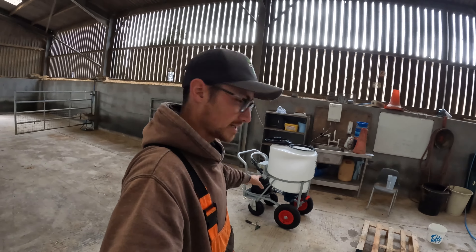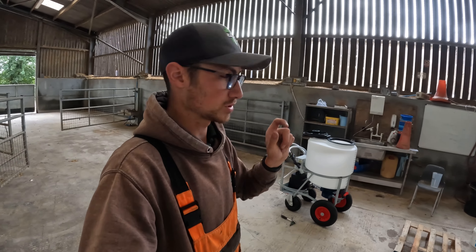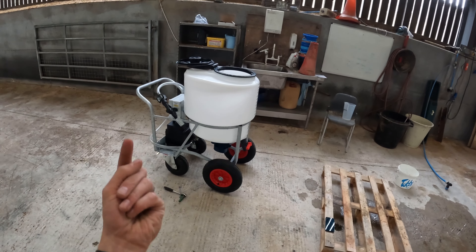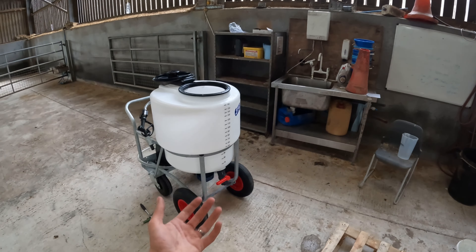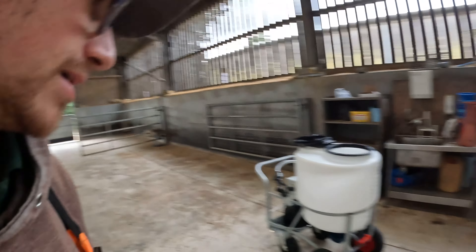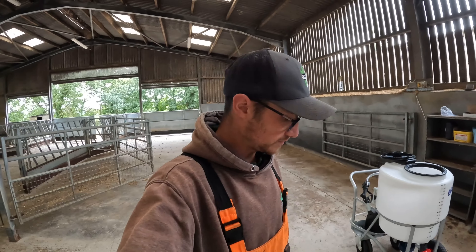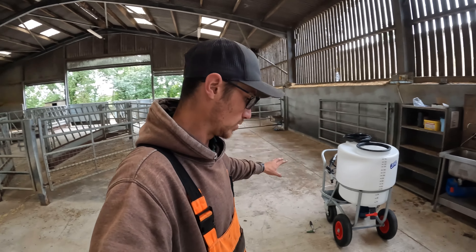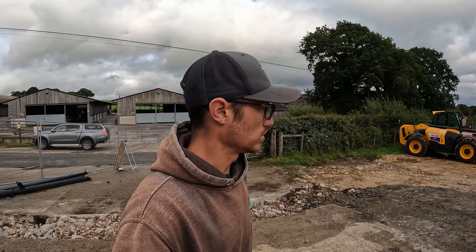I am pleased to announce I've finally done it. The O-ring that sits on the bottom of that pump or mixer motor was pinched on every corner where the bolts go in - it's just been over-tightened. What I ended up doing was pulling the whole thing off, taking all the weight off the O-ring, pulling the O-ring off, putting it back on the seam it's supposed to sit on, and then just bolting it up so it's just touching on both the pump side and the skin of the feeder. As you can see, there was water in there all the way around it - if it was going to be leaking it would be leaking now. God, flipping hell, that should not have been that hard. But I'm glad to say it's now working. I'm going to leave it before I mess it up even more.